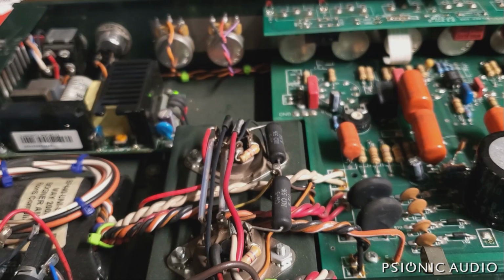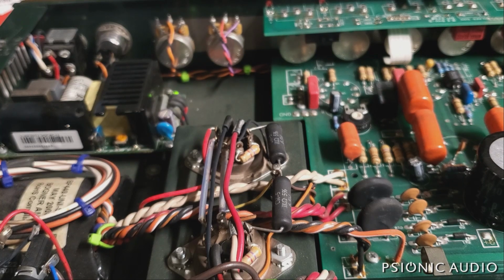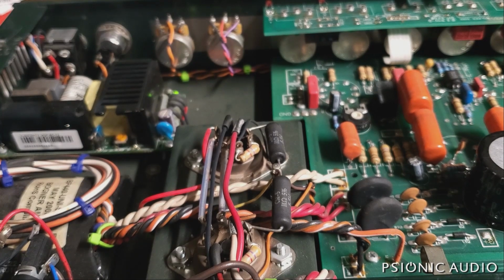Well, the owner of this Shiva got extraordinarily lucky. It was just that thermistor that burned. It wasn't crucial to the operation of the amp. There's a proper 3 amp fuse in now. I verified the bias is still good, and the bias is not drifting, which can happen after you've had issues. The resistor, which had discoloration on it that I showed, was one of the 220K grid leaks in the output, or bias leaks as they're also called. So that was changed, and it has the correct fuses, and it's been stable now for more than an hour. So this owner got extraordinarily lucky.